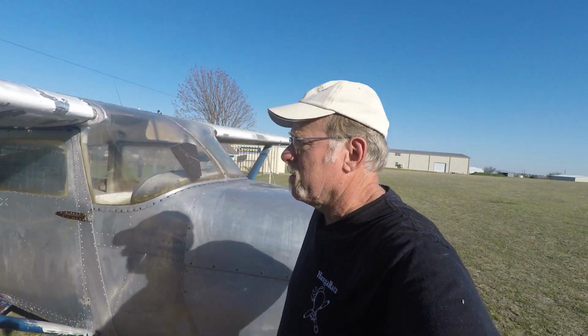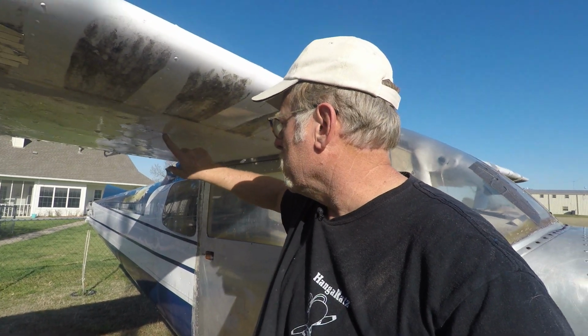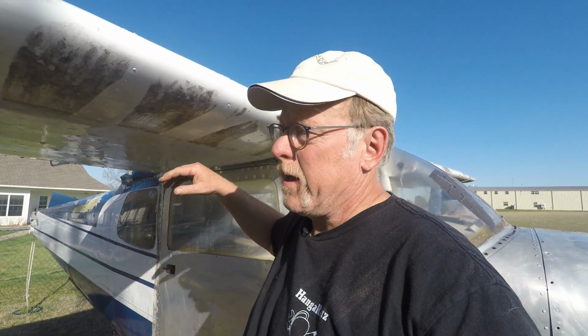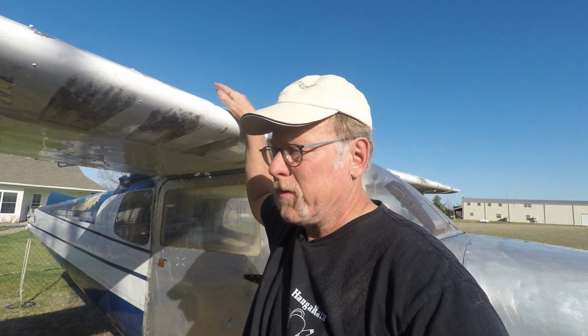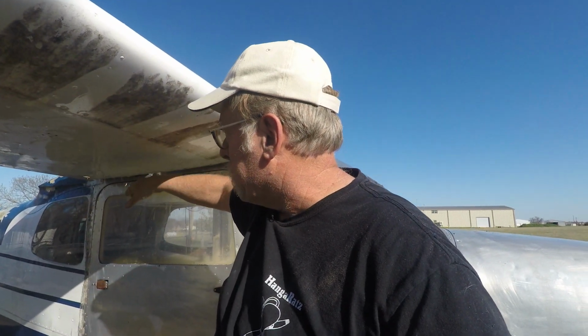Okay guys, let's walk around this thing, see what we've got ourselves into. So the sun's starting to set, hopefully it'll be a little nicer, but we'll walk around, check out all this different stuff. Okay, the wings. Let's talk about the wings. The wings had a lot of hail damage, we know that. They have to be reskinned, so much so that, I don't know if you can see this, there's a lot of water here, but there's actually dents on the bottom of this wing from the hail going through. We had the fuel tanks and the fuel tank covers off, great. They're inside the airplane, great. But because there's an open hole up there, it actually bent the bottom skin because the hail came through and hit the top and did that.